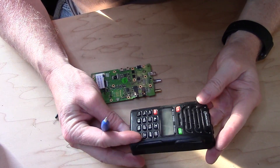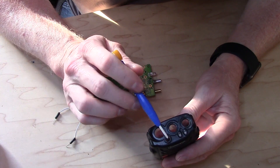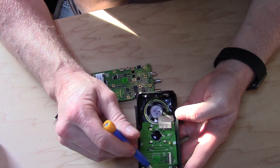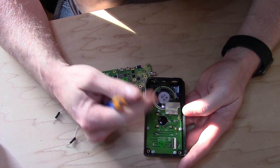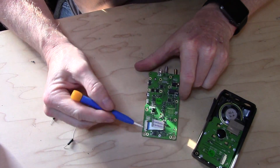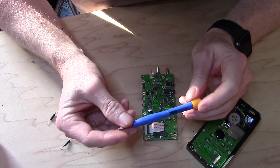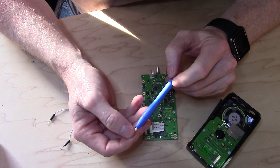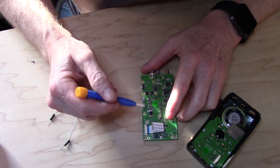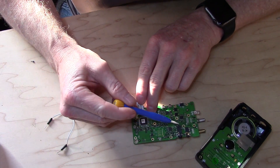Here we've got the case apart - this is the actual case. You've got a couple of controls and the antenna output. One thing you want to be careful of: the lower board, you'll actually have to get up underneath this side and pry it up just a bit. There is this one connector here that you need to disconnect - it connects to this ribbon cable. You want to be real careful. These non-conductive screwdrivers are really handy for getting in here and popping these connectors loose without damaging the board or the connector.